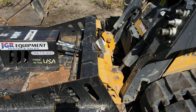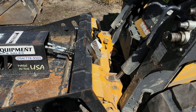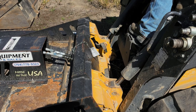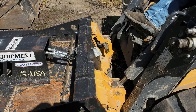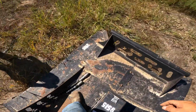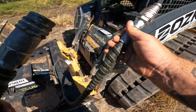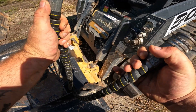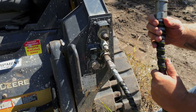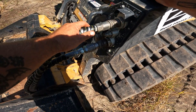Now that we've squared up with our bush hog, we come in and use those same latches we lifted to unhinge the bucket — now we press them down to lock in the bush hog. Step out of the machine and press down on the locks to secure the bush hog to the machine. Cut the machine off to hook up the hydraulic connections — always keep the machine off when hooking up hydraulic connections because of the pressure. You typically have two connections: one inlet and one outlet for your hydraulic flow. Match them up to where they fit. Press in on the male connection and it locks onto the hydraulic fitting, then connect the female connection.